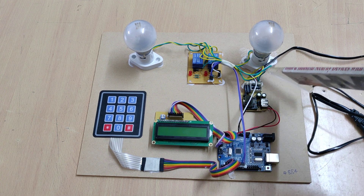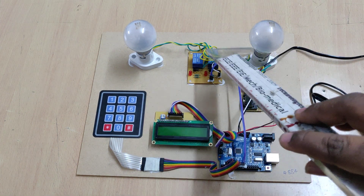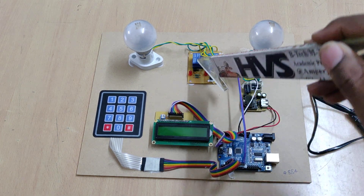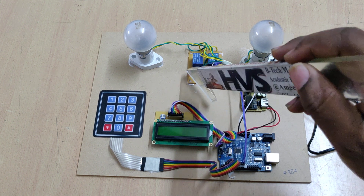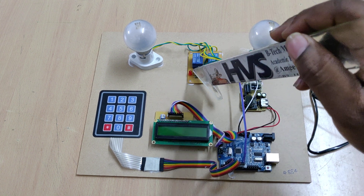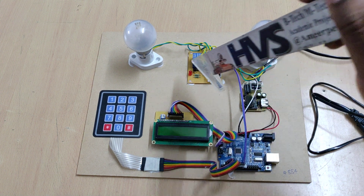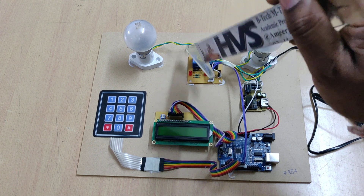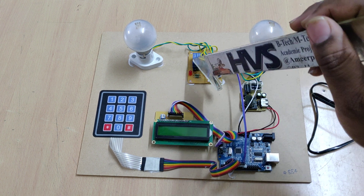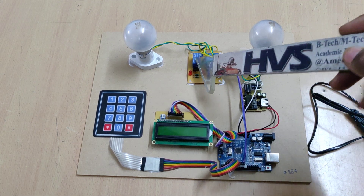In parallel, we provide 230 volts output to the circuit breakers through electromagnetic relays connected in series with the load. When trigger pulses are provided, two transistors, two LEDs, two diodes, and resistors are used. Resistors limit current; transistors receive the trigger from the Uno board to control the relays. The Uno board switches on the transistor, the transistor switches on the relay, and the relay switches on the circuit breaker. LEDs show relay status.